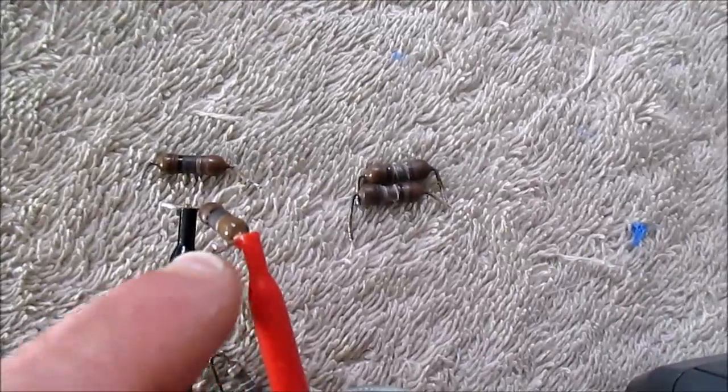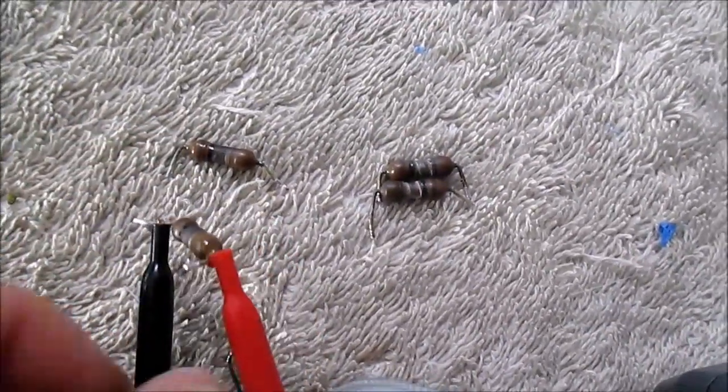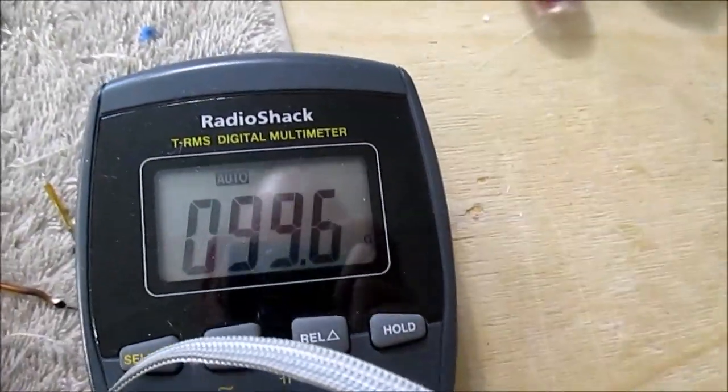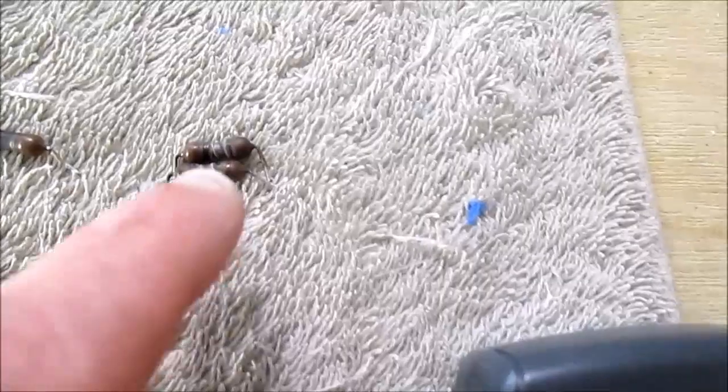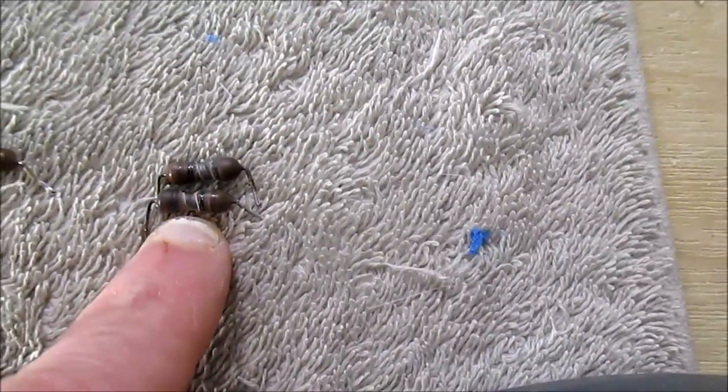Despite being cooked a little bit — these weren't real bad but they have signs of stress — they're 100 ohm resistors and they measure right on. But these others got cooked a lot more and they read open, both of them.